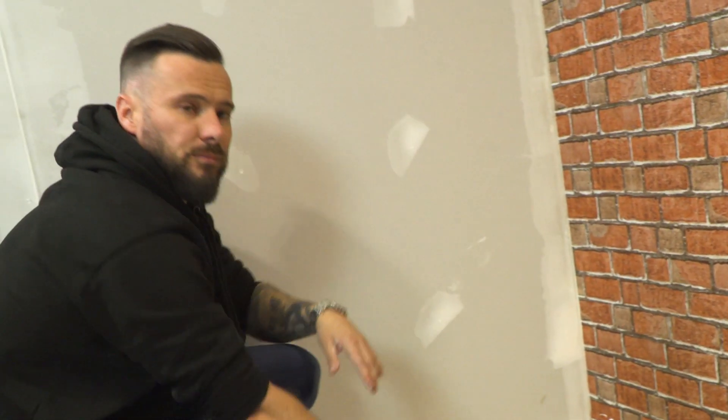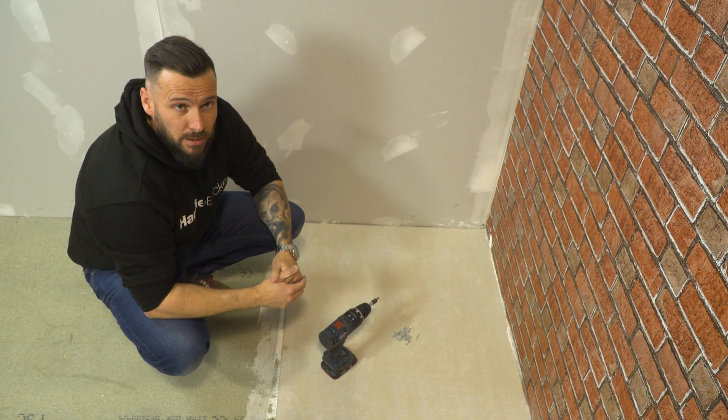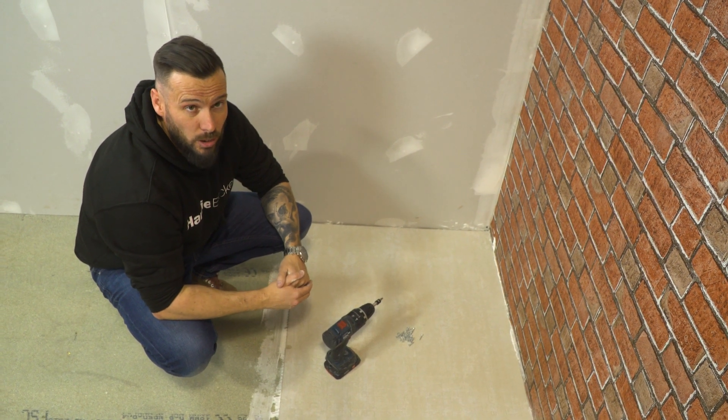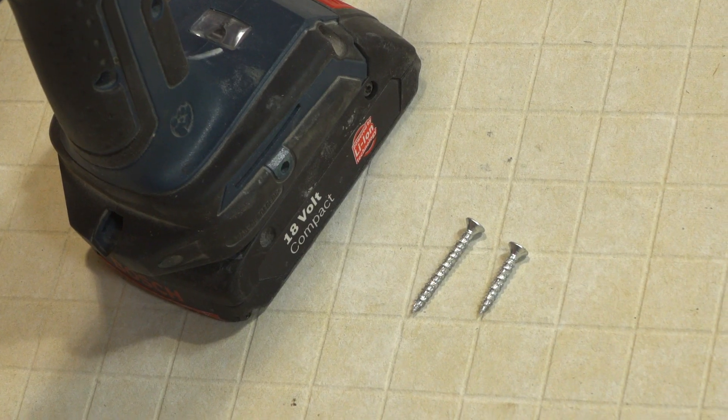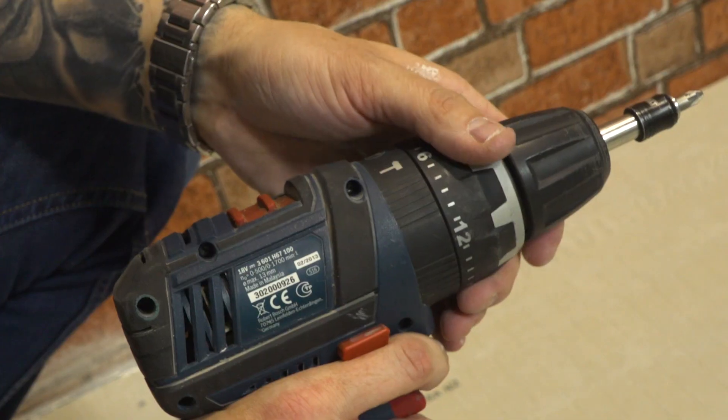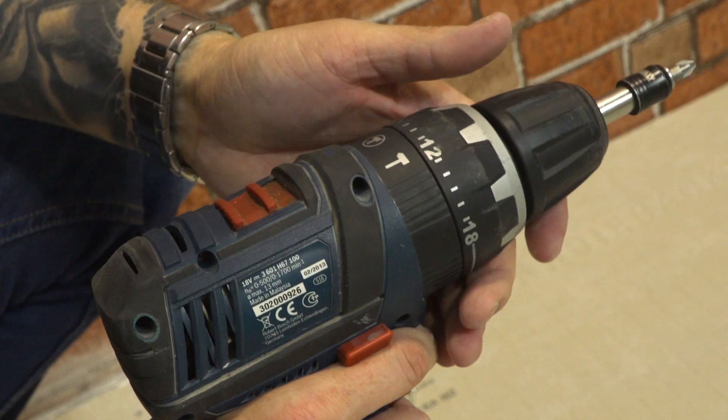When you finish the room, just point it up with a good quality sealant. Six mil HardieBacker — we used to recommend a minimum of 40 screws, now it's only 12. Make sure you've got the right screw: 25 mil for floor and 30 mil for wall. You might need to adjust the torque in order to get them to sit flush.